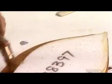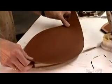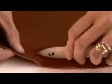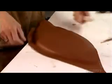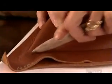Now she glues foam to a hard piece of leather to make a knee pad and sticks softer leather on the top where the rider's knee will rest. Then, using a piece of whalebone, she draws the leather tight around the edges so that it's smooth on top. Whalebone is used because it doesn't scar or scratch leather.